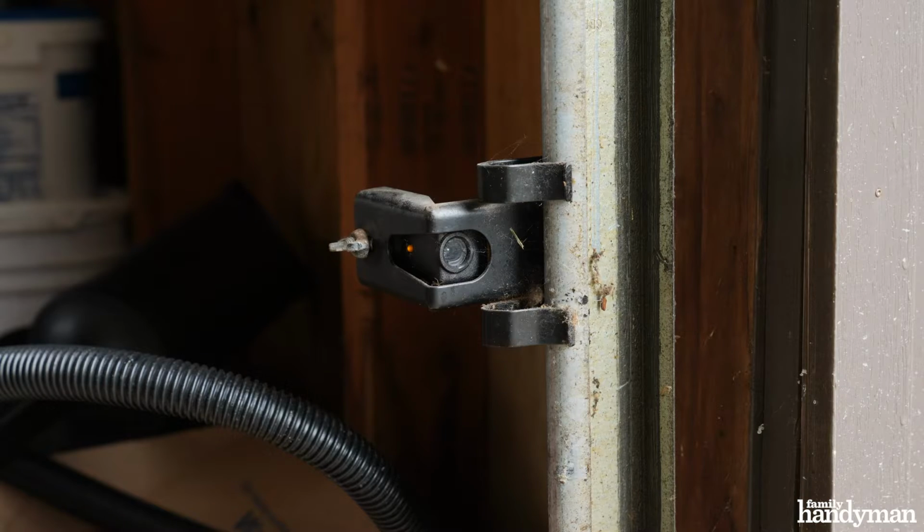Now, the MyQ Hub is a great way to retrofit your old garage door opener to be smart, but it has some requirements. You need a smartphone, you need a wireless router that will reach the garage, and you need a garage door opener made after 1993, but it must have the safety sensors that are mounted on the garage door rails.